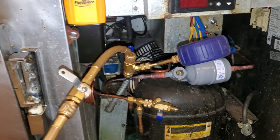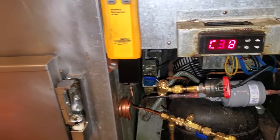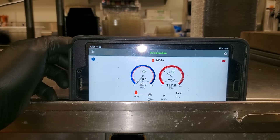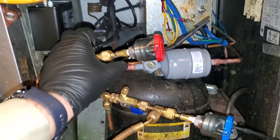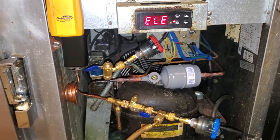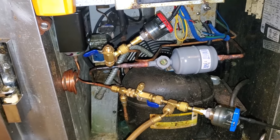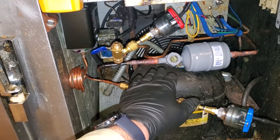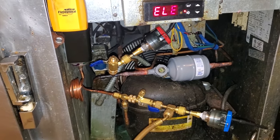Give it a couple of seconds and then we'll flip the power switch — we should come on via low pressure. Alright, let's turn it on. It cut in at about 20 psi on the low side. Take a look at that sight glass — we're going to let it run for a bit and see if it stays clear. The reason I mention that is because this system wasn't originally designed with a sight glass, so we have to account for that extra volume of space. We put in the factory charge and we'll see what happens.